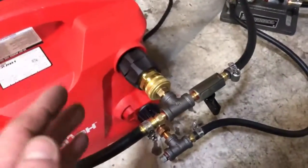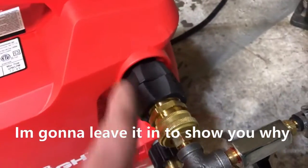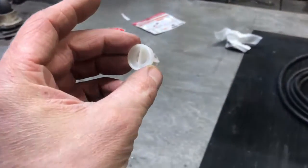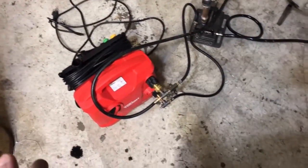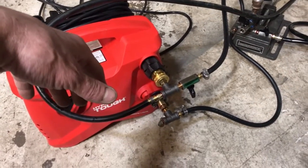I can't stress enough the need to pull the filters out of this thing. There are two filters in here — there's a screen filter in the end of this black thing, it's a dome-shaped filter, and there's also a plastic insert filter that's usually inserted inside the neck of these things. When you get the pressure washer, this part won't be on there, and you'll see inside the spud a little filter. We're going to want to get that out of there. Waste oil has a fibrous, hairy-like material in it — I think it may be from the filters in engines, I'm not sure. What I have learned over the years is that waste oil must be pre-filtered or gravity filtered, and the systems you're using it on cannot have any filters on it or you will clog up in a matter of hours.